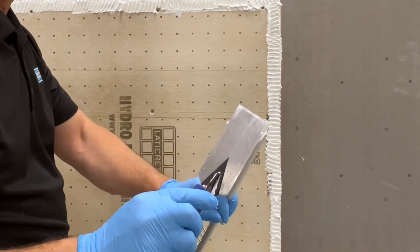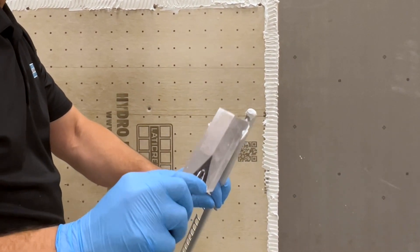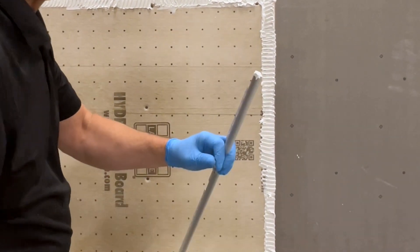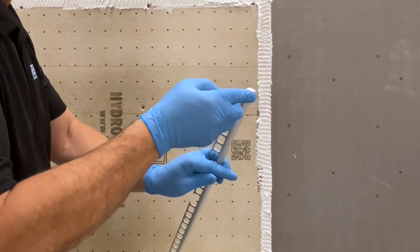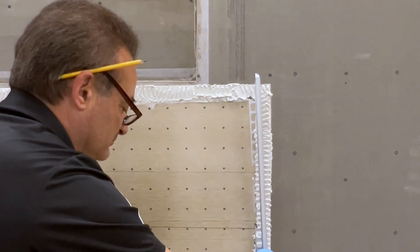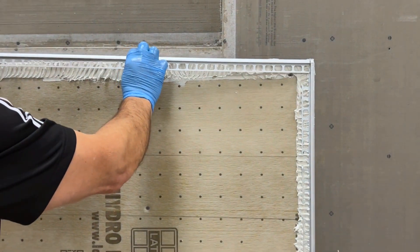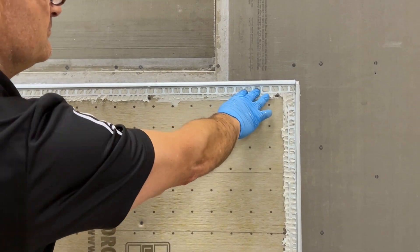Once you have cut all your pieces and ensured a proper fit, install your outside corner piece by adding a small amount of tile adhesive into the profile end. This will help to hold the corner in place as you match up the other profile piece. Wipe away any excess adhesive from the corner surface. Press the round edge profile into the adhesive bed and align. Bring the second profile into place, aligning with the corner piece. Make sure that the mounting legs of the two profiles were properly trimmed to not overlap.